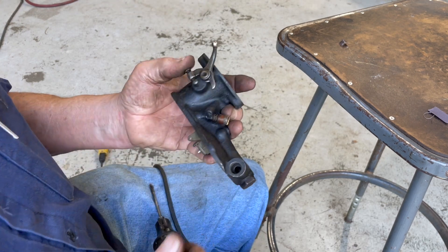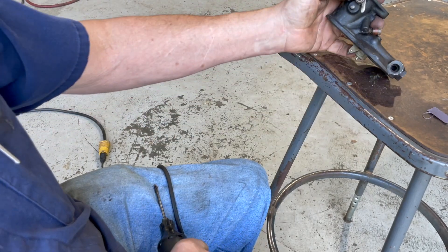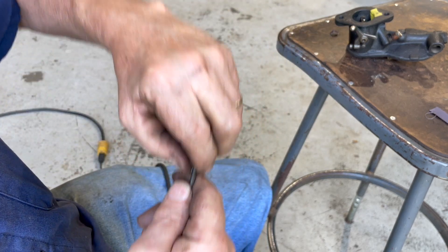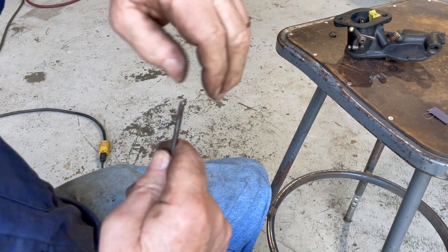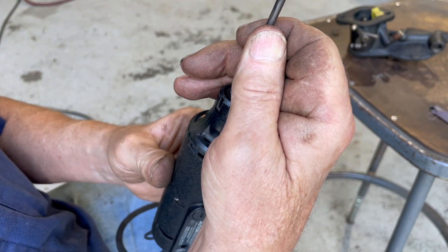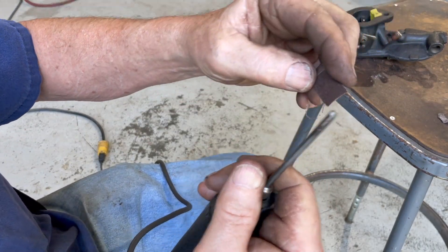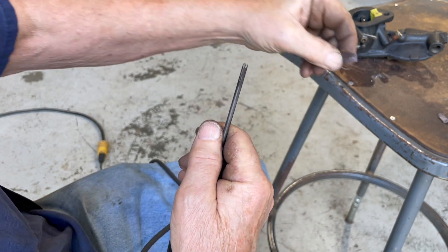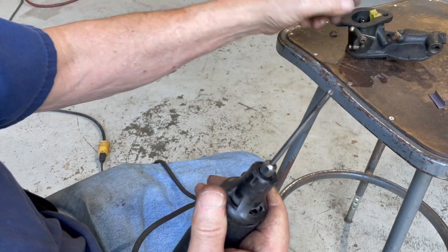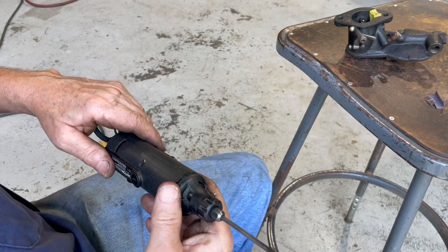That's all there is to it. Got a good nice fit on that thing. Now this is just a homemade what you call a flapper — it's just a piece of one-eighth inch rod. I took a hacksaw and sawed a slot in it, and then you just tear off a piece of sandpaper and fold it over. I had too big a piece when I first started, so you can see it didn't take hardly anything. They work pretty good on something like this, so hope you guys enjoyed this. Thanks for watching.